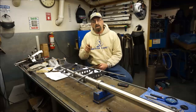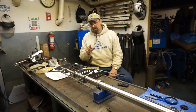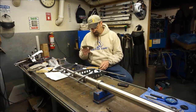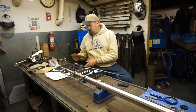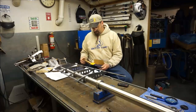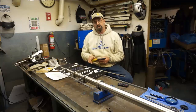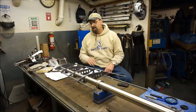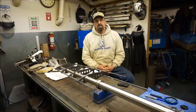A lot of times on a lot of my glands, you need to have an eighth of an inch slot in there so that when you draw the bolt together, you've got the clamping. So I will definitely use these. I appreciate it very much. And I think this is the second package, so I've got to get one heading your way as well. I enjoy things coming in here, but I also can give a few things out myself.